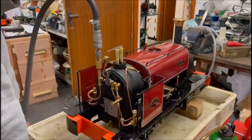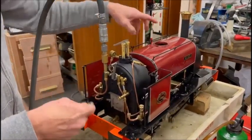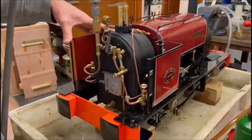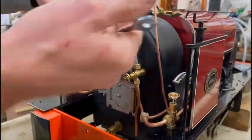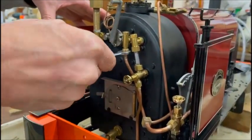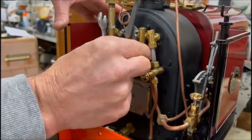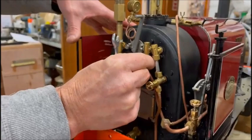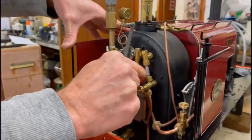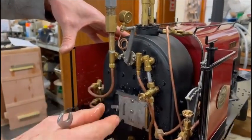The other way to tell if the pump's working — and I suggest you only do this when you've got cold water in it — you can just undo this little nut here. The check valve has a ball bearing in it, which is a one-way valve, so no pressure should be able to come back. If you open this little nut off, you should get quite a lot of water squirting out. As you can see, if you pull that off, it's squirting water — and if it's squirting water, you know that's pumping.